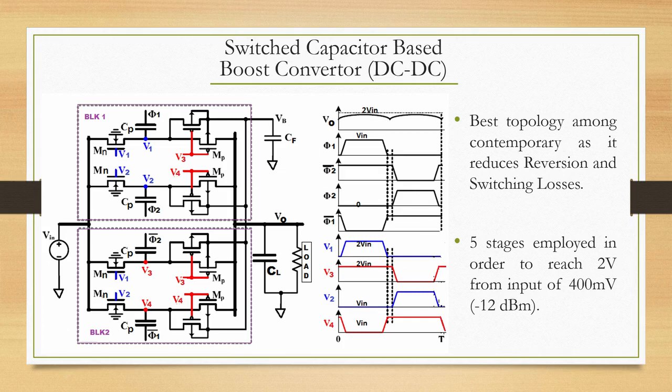Okay, the other best way would be the ones that we know very well from the previous discussions. If you take buck converters, we actually put inductors, right. There is an output inductor at the output, and we also spoke about the inductor current, the picture that I showed there. That is one way of doing it. You can also have inductors on chip, but then they are a lot harder to achieve, but it is possible. It is not that you can't do without inductors, you can do inductors on chip as well.